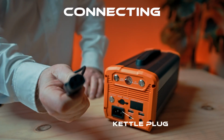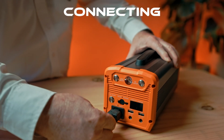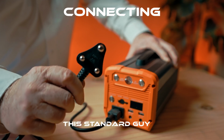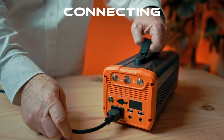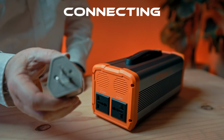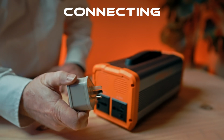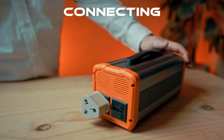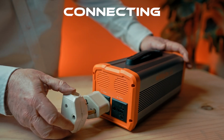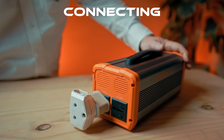Right, so this is what we call the kettle plug, kettle socket, and it plugs in here like that. The other end is your regular 3-pin plug that goes into your socket in the wall, which I'm going to do now. All right, now I'm going to show you what happens on the other end of the box. This adapter, which you're familiar with those 3 pins, but those are Euro pins. This has a Euro socket on it. This would plug in over here, and then you would plug in your regular adapter or multi-plug in there, and that would go off to your devices, whatever they may be, television, computers, whatever it may be.